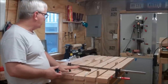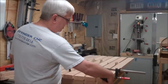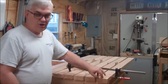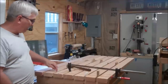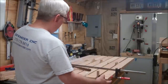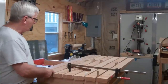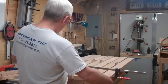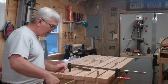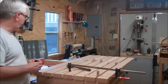I'm working on the picnic table part of it, and I just wanted to point out you want to try to make sure this comes out even. This piece is 27½ inches, which if you take seven 2x4s at 3½ inches plus a ½ inch spacer — you can see I've got these little spacers in here — it should theoretically work out to 27½. But you may want to check the width of your 2x4s and make sure it's right at 3½. If it's bigger or smaller, you may have to adjust your spacing. I'm also being careful to keep this 1¾ inches hanging over here, because that's the dimension I need for it to fit on that other piece.